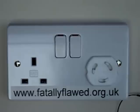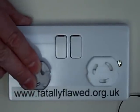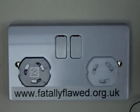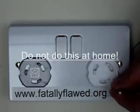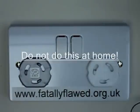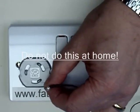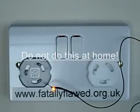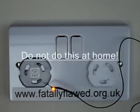I'm going to put a couple of covers in here. That one is made by IKEA, and this one — which is physically just about identical apart from the colour — is made by Mothercare. If I go to here, there's a very small hole, but big enough to put a pin or a paper clip in, and now we've exposed the live wire. This could kill a child. Exactly the same thing with the Mothercare version — I'll put my probe into that small hole and you will see it light up. We've touched the live connection. So a perfectly safe socket has been rendered unsafe by the use of a safety socket cover.